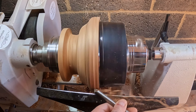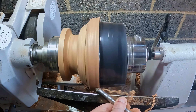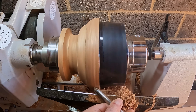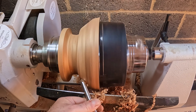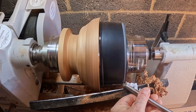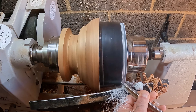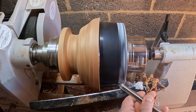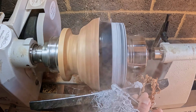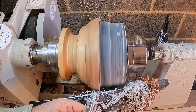After 30 minutes the joint was strong enough for me to start shaping the sapele top section into the resin. When I made the larger sapele ring I knew it was bigger than the resin blank, but after seeing it I realised it offered a design feature worth exploring. I used the bowl gouge to shear scrape some more away from the sapele and get the resin blended around. Then using the same gouge I cut a chamfer into the underside of the lower sapele ring, then switched to the skew to sharpen it up and clean up the resin joint.